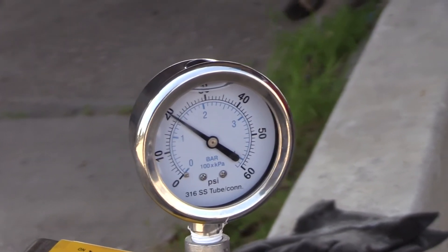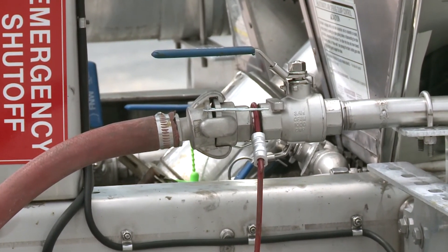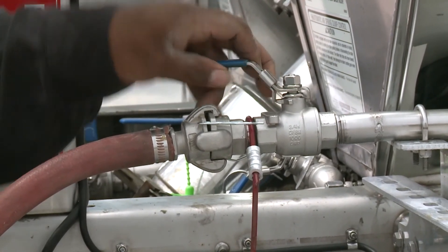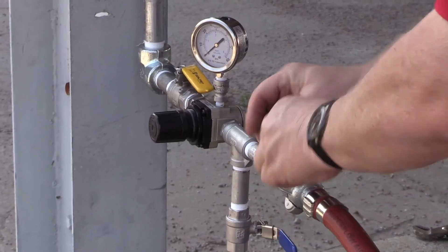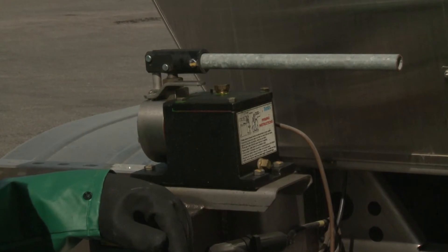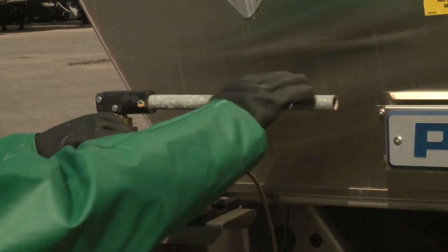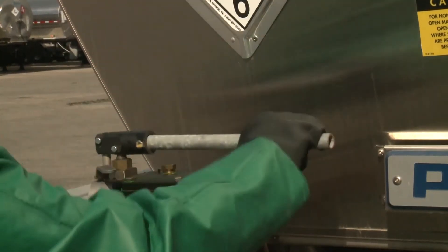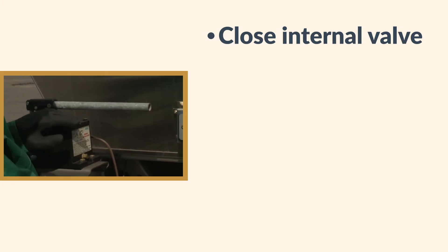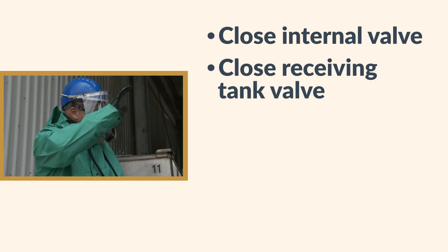Monitor the operation to ensure the pad of nitrogen or dry air is maintained in the tank truck. Once the cargo tank trailer has been emptied, disconnect from the system with the same care as it was connected. First, close the nitrogen or dry air inlet valve on the tank truck and shut off the nitrogen or dry air source. Then, close the internal valve on the tank truck. Wait a suitable time to allow completion of the closure shut-off process, about a minute in most cases. Then, open the internal valve to blow the hose clear to the storage tank. Repeat as necessary to ensure the tank container hose is empty. Be careful not to over-pressurize the receiving tank during the hose clearing operation. After the hose is cleared, close the internal valve on the tank truck and the valve on the receiving line. Close the tank and receiving line simultaneously to avoid backflow of product into the hose.